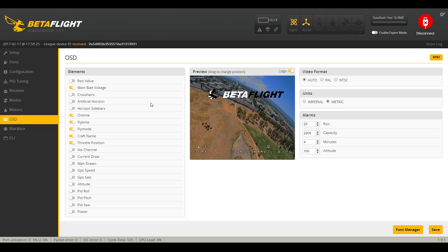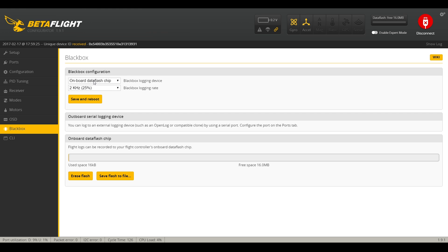Nothing in the motors tab. For OSD, I've turned off the artificial horizon and sidebars — I don't think you need them. Main battery voltage is right in the centre and will start flashing when it drops below the voltage set in configuration. I've got on-time, fly-time, and an alarm for 4 minutes on fly-time — around 4 minutes means I'll be towards the end of the battery. Throttle position is there too since it doesn't take up much screen real estate and is interesting to see when reviewing DVR footage.